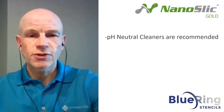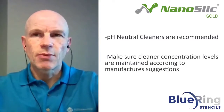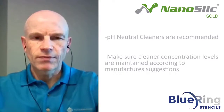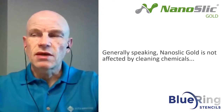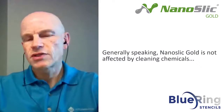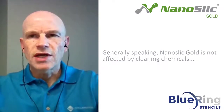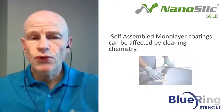Thank you, Greg. Chemistry compatibility seems to have been a focus for coating damage over the years. We've talked a lot about the pH of cleaners or the concentration of cleaners, but there's definitely been a lot of discussion about cleaning chemicals and how they might impact the coating. Generally speaking, the coating is not damaged by cleaning chemicals. It's very chemically inert, it's very chemically impervious, as opposed to wipe-on type coatings, which are one molecule thick.